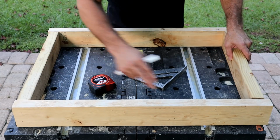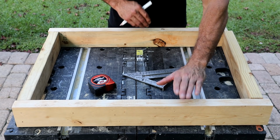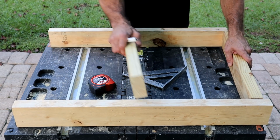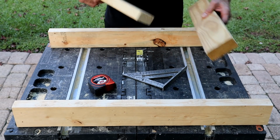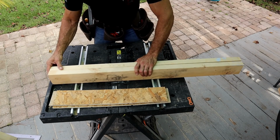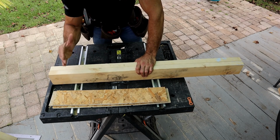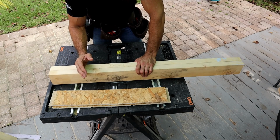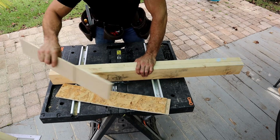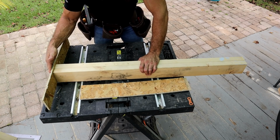All right, right here is your frame for your floor. This and this, these two are called rim joists. These are floor joists. They go in between my rim joists, okay? That's a front and back rim joist, depending on how you're looking at it. If my total width is 12 feet, then I can either cut this exactly 12 feet, or if I'm under specs and I have to have the exact dimension, I will subtract the thickness of my sheathing right here.